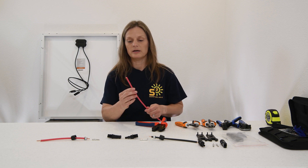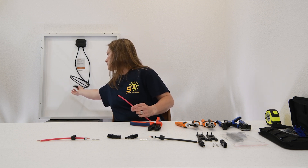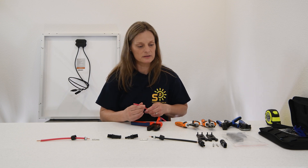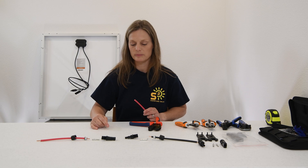The Staubli ones we sell here at Signature Solar do have a track record of being high quality. So do your research on whatever you are purchasing and make sure they have a good track record. Let's get started with our positive red wire that we will connect to our male connector here. We'll use our female terminal end, since we've decided we need a male connector paired with our female terminal end.